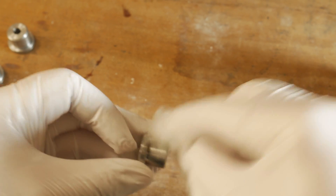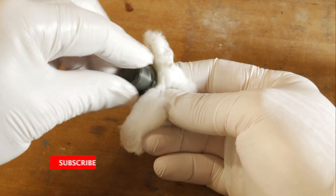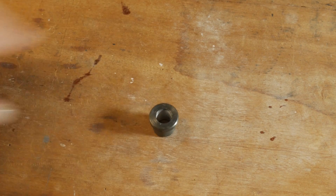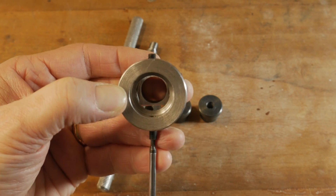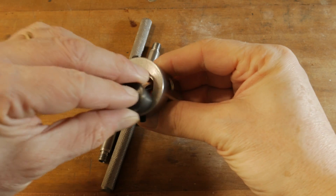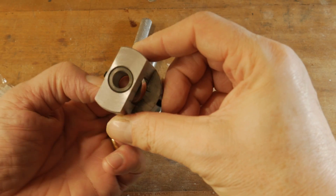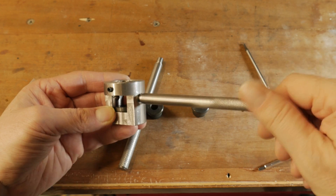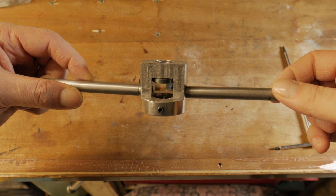Fit and insertion is accurate with all surfaces in contact. It will be interesting to test with a long thread and see where the chips end up. I also imagine that the chips themselves keep the bushing pushed into position. After collecting all the necessary parts I started the assembly — I was really curious to see how everything fit together. I didn't find it difficult but the tolerances were certainly a bit narrow in my opinion; as we say, there is always time to widen. The insertion of the bushing is not immediate, but in a few seconds it is in place.